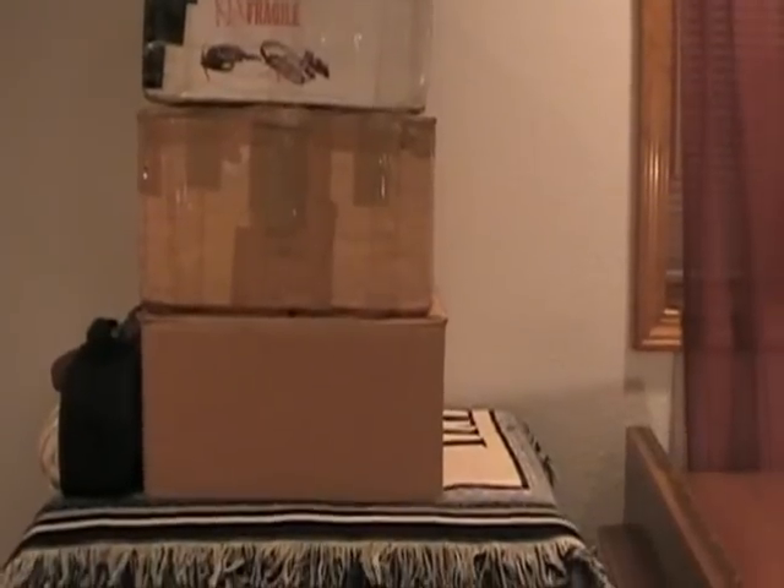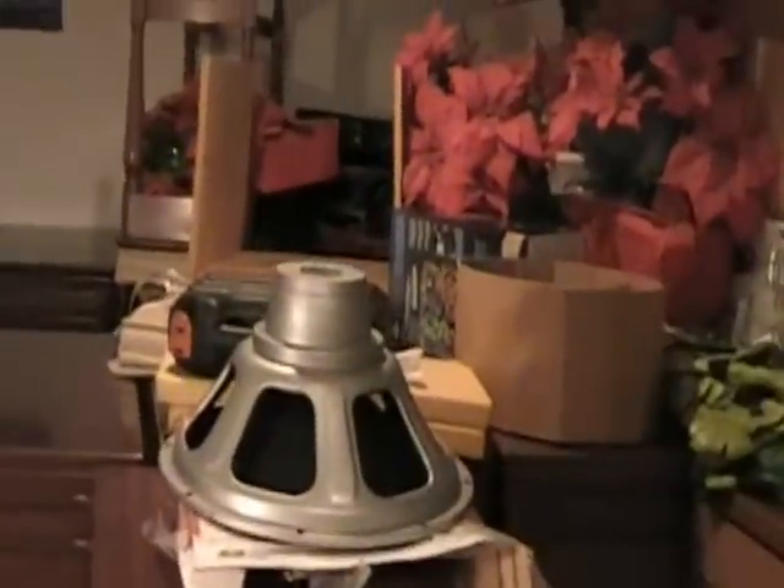Here you see some boxes. These boxes have speakers that need to be re-coned. I just took about 21 or 22 of these types of professional speakers — these are woofers that go in the bottom of Leslie's, right down in there. You have to have them re-coned; otherwise, if you put used speakers into these Leslie cabinets, they'll blow.